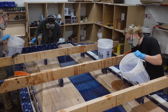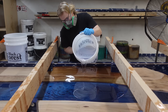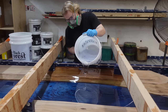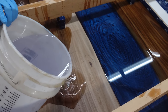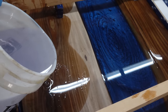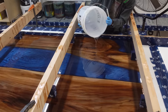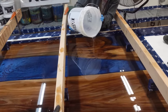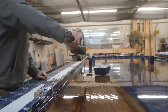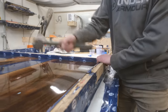This client selected our standard square steel frames — three-quarter inch by four inch steel welded into a square with a quarter inch top plate. If we didn't have this opaque layer, you would see that plate through your pour, which isn't necessarily a bad look but not every client wants that. After curing for one week in the mold we can pop the piece out of the form.